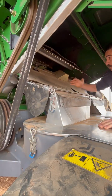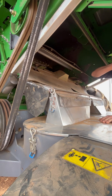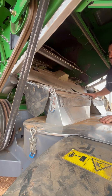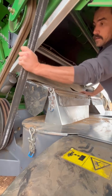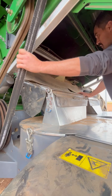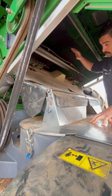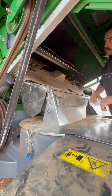So now when we pull the chopper back home, everything from the sieves is going straight into the chopper. We'd also take our belt off the gearbox and store that away safely so the Terminator won't be running. All the sieve material and all the material from the discharge beater is going straight into the chopper.